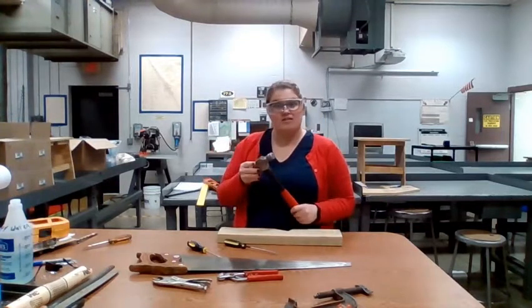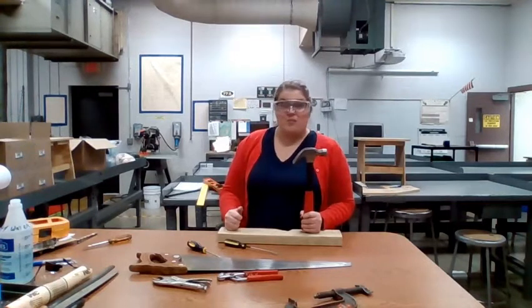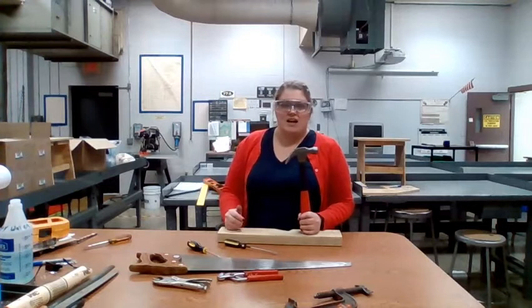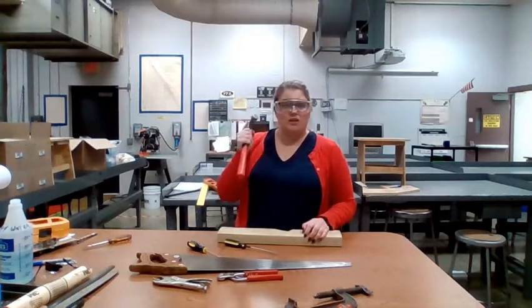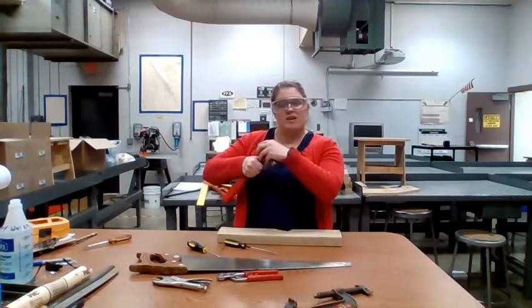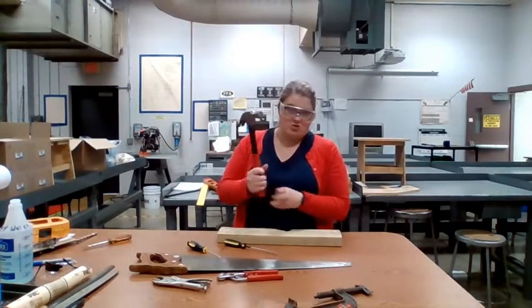Hammers are balanced. And you can get them for different weights and different pounds. There's a couple that my dad, who's been a carpenter my entire life, has that I can hardly use. Like I can't swing them, and there's a few that he could barely swing as well. And the reason that they are weighted that way is so that they do the work. You don't want to wear out by holding it up here. As I swing it, I can feel that the weight of the head up here is pulling my arm down. Well, I'm going to let that hammer do the work for me.